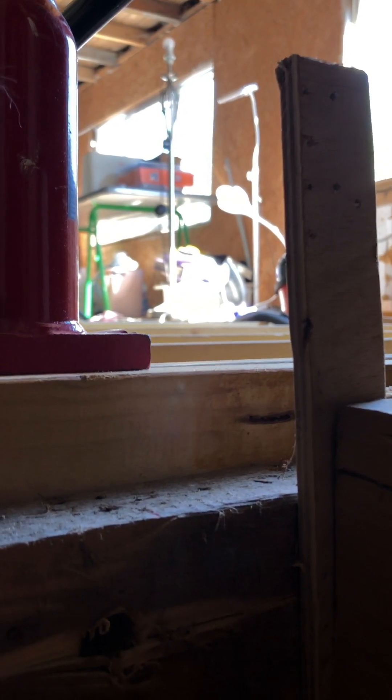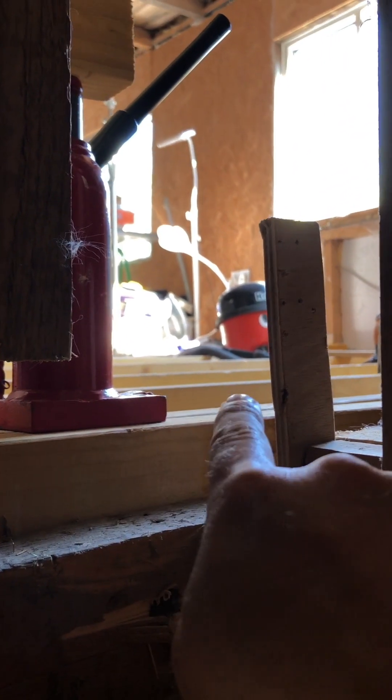This one's still slightly high because the intermediate ones over there are disappearing from view before this closer one. It's a little hard to see with the camera instead of just the naked eye because of how it's trying to focus. You can hopefully see how they're getting closer and closer to lining up — that joist, that joist, that joist, all the ones as I go further out. We want them all to line up with each other right at the same instant. Viewing at a skewed angle, but I've gone straight across from the other direction and watched all the joists come right into alignment at the last second.